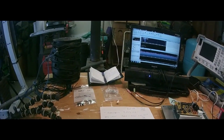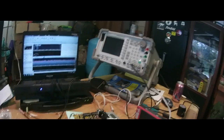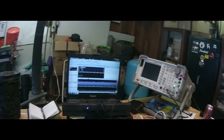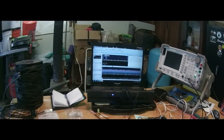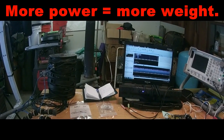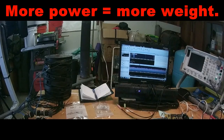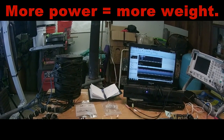I started looking around the internet and some YouTube videos. There are some people out there that do QRP transmitting on HF. QRP is ham speak for low power transmission. If you transmit less than 10 watts — a lot of them say less than 5 watts out to the world — that is low power transmission.